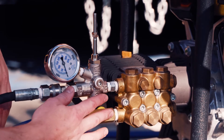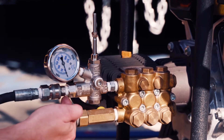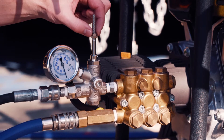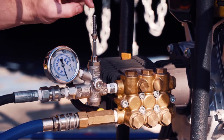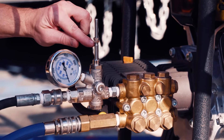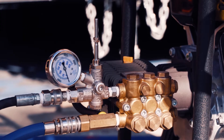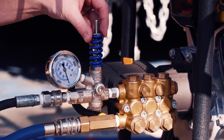After installing all the components, we've got our pressure gauge right here, we've got everything connected, and we've got our bypass on the back end. Now we're going to set our double nut on the pin about a quarter inch to maybe half an inch above the base, and we're going to put our blue spring on.